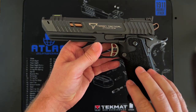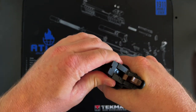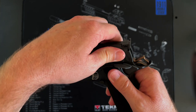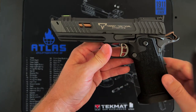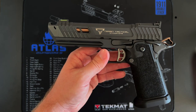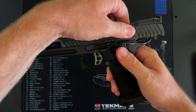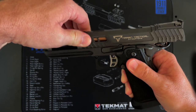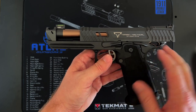Let's talk about things I think are extremely good. First off, this gun has no side-to-side frame movement whatsoever. The Staccato XCs always have a good bit of frame-to-slide movement. Vertical movement — it does have just a click of vertical movement, and they all do. I've talked about this with Nighthawks — their hand fitment is real hit and miss, ranging from extremely tight to very loose. The other thing I checked is that when you pull the slide back, that movement goes away. But there is just a touch of side-to-side movement in the front, which tells me somebody hand fit this frame — if it was done by machine, it wouldn't have that little bit of tolerance.